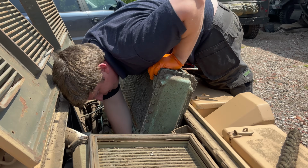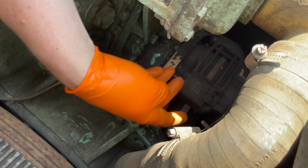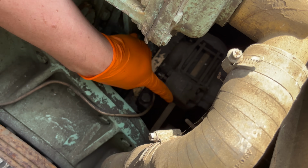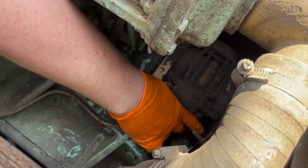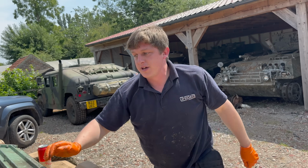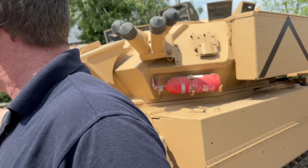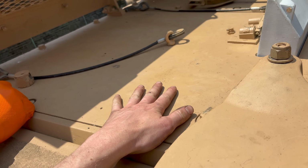Oh no, it's that one up there, the smaller one. See, there's one hidden at the top. Which again doesn't look wet. The big ones are your main brakes. That small one's your steering brake. It's not that. It doesn't look wet. So I would imagine it's the master cylinder underneath that. Let's take this top plate off and get in there.